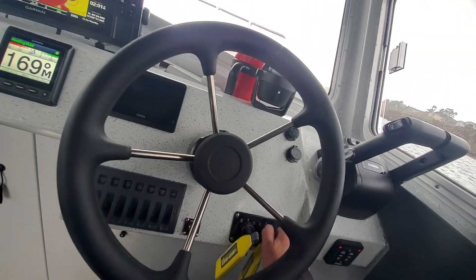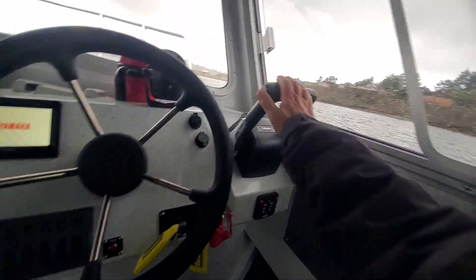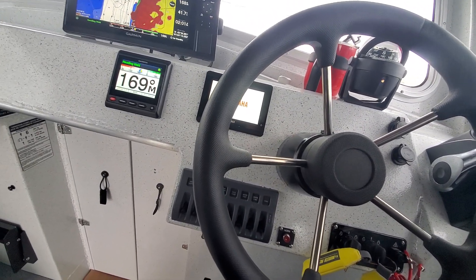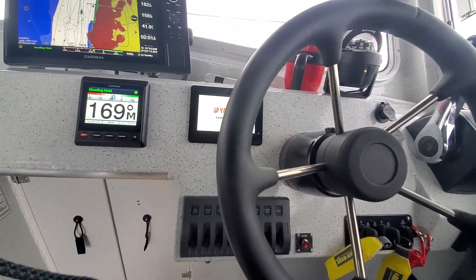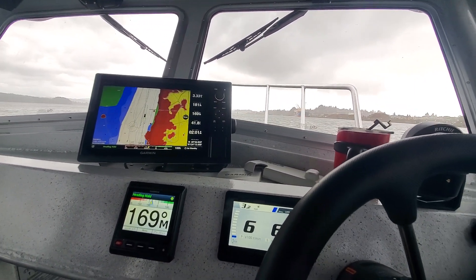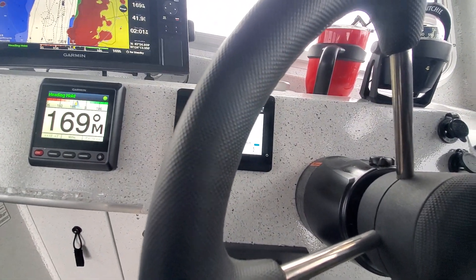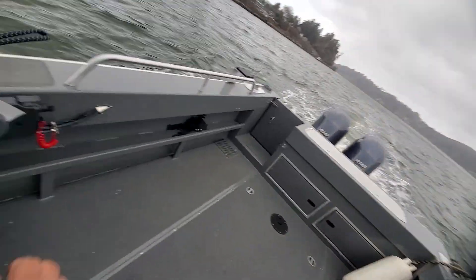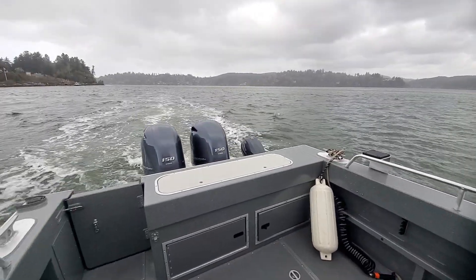Now say I want to fire up the mains — this has got the new command link gauge. Make sure these are in neutral and this will come on. As soon as those things fire up I'll just put these in gear. It's holding pretty good actually — 182, 180. So I'm going to speed these up a little bit. You don't want to go too fast — about 1200 RPM. Then you take this, get this back, shut that off. Now we're running autopilot on the main.